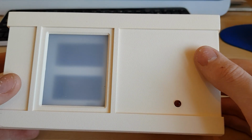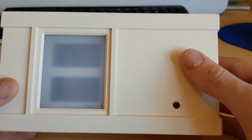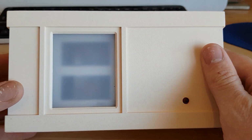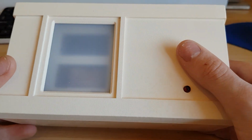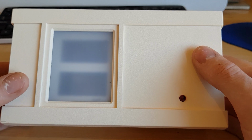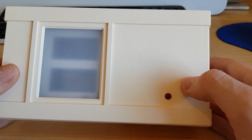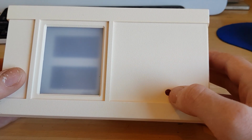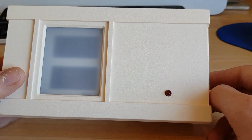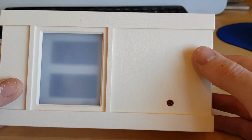If the LED is behind the lens at night, the whole lens lights up red, and it's really noticeable. And most people don't want attention drawn to things like a PIR in the house. They want them to sit discreetly in the corner, which is why I thought it was always, well, you couldn't have this particular one sitting discreetly in the corner. You couldn't have this sitting discreetly anywhere. But I like the style it uses for the LED alarm indicator. What I think's best is just to have a full-sized LED drilled through the casing, and that just comes on when motion's detected. It's a lot better than having something behind the lens or a green and amber and red colour changing LED.